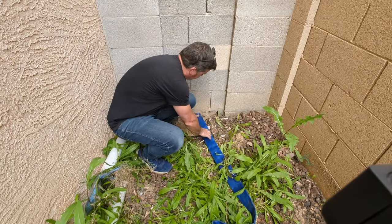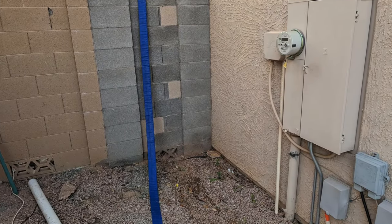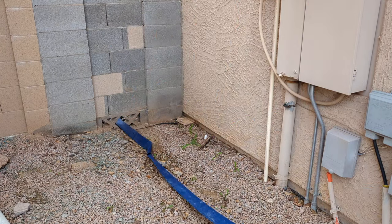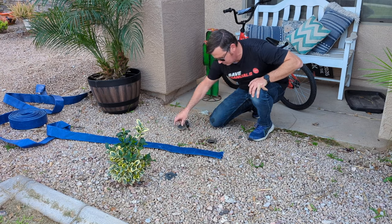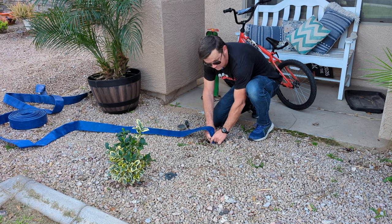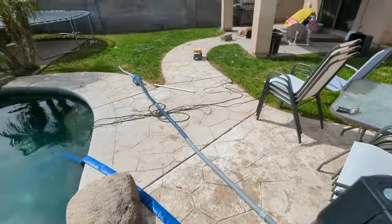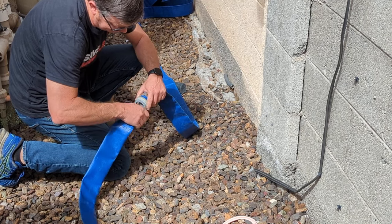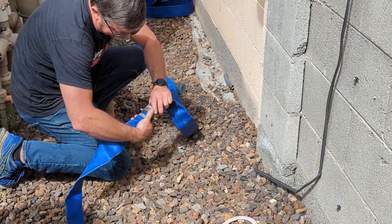You'll see I'm trying to feed the hose under the fence. In this particular home we can do that. Once you feed it under the fence, put a rock over the top of it once it's down in there. If you need to, you can put it over the top of the fence — but if you don't have to, feed it through. We really just want to get it from the front yard to the backyard. I'm opening the sewer cap closest to the house and feeding the hose in about two or three feet, just enough so it will hold, then put that rock on top. Make sure the line is straight, not coiled up — if so, you'll have problems with the water flow. I'm attaching an additional hose since the hose wasn't long enough to reach from the front yard to the backyard.